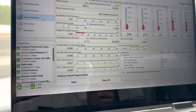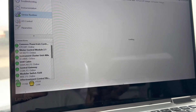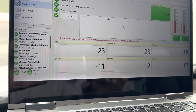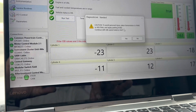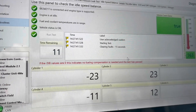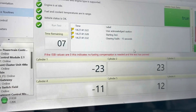I want to do an idle speed balance test to get a reference before starting the regen. A 30 to 40, maybe 45-minute regen max would be within spec. The test will use numbers the computer has stored. I'll click yes — it does a quick countdown and then another countdown. It'll run for 90 seconds.